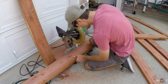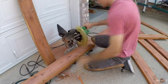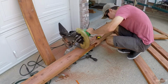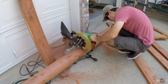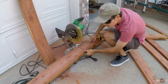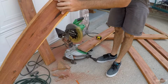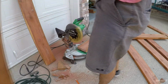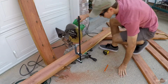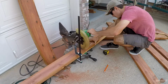I'm chopping up the boards to size you saw in the previous segment, trying to get a tabletop worked out. And the tabletop was 18 inches deep by 48 inches wide. That's what I started off with, at least. With a thickness of, I guess it doesn't matter in the long run, maybe initially it was like 1.5 inches, maybe 2 inches, right? And I ended up having to shave it down so far because the boards were not straight at all, right? So I had to take off a lot of thickness on either side to get them kind of straight, right? Or kind of flat, I'm sorry.